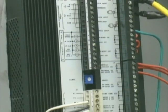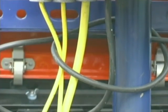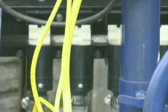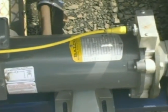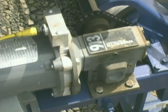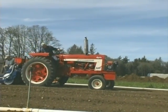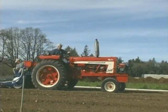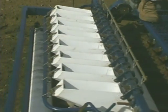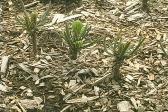What the computer does is to simply take a signal from the sensor judging forward speed and from the sensor judging the revolutions per minute on the DC motor, and set up a relationship between the two. This relationship equates to the spacing between the seeds that the nurseryman has selected. If the tractor speeds up, the drum speeds up. If the tractor slows down, the drum slows down. So you maintain that spacing — the critical spacing.